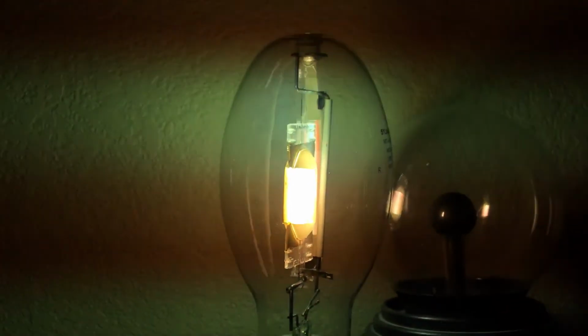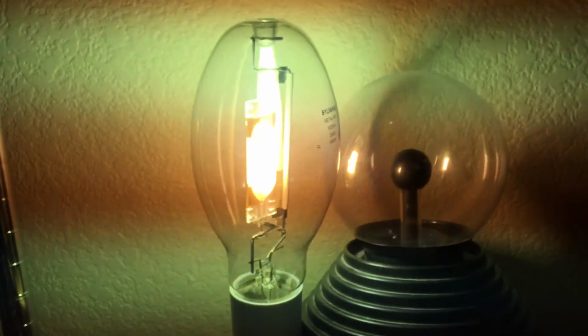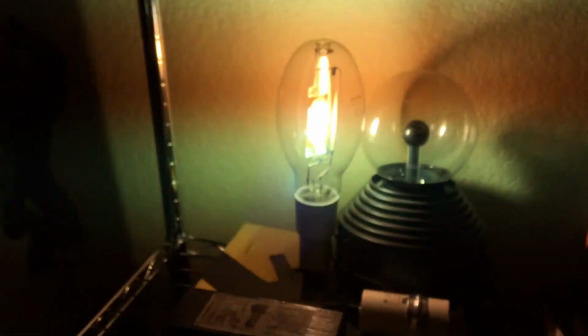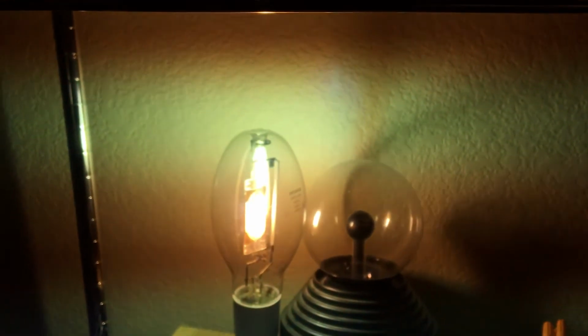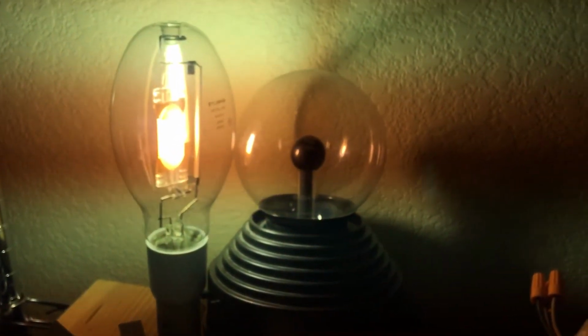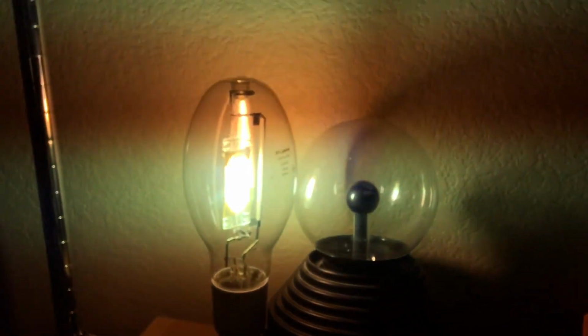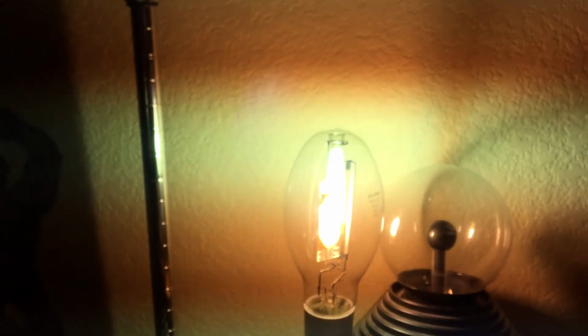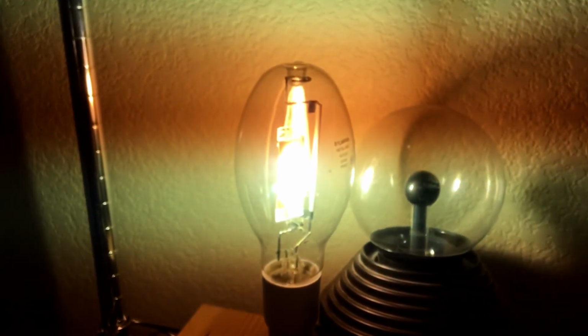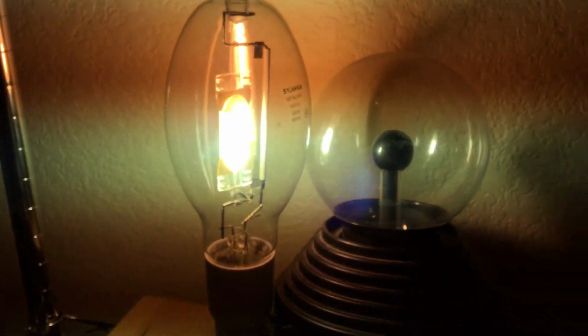So the Sylvania metal halide bulb is now at full brightness, and let me tell you, it is bright in here. As you can see, I was right. The color temperature decreases as the halide salts fog up the arc tube. It's 4200K in the arc stream, but it's actually about 3500K, or neutral white, right now. You can see this bulb lights up this room quite nicely in very nice neutral white, but I'm going to put cool white, or 4200K, in the description below of this video.